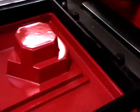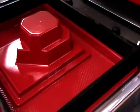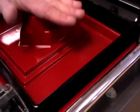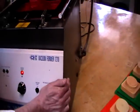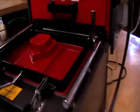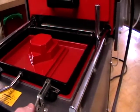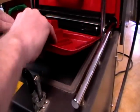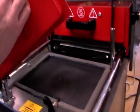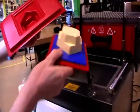How cool is that! It's still quite hot. This is one millimeter rigid polystyrene which will cool quicker than the two mil. Now I'm going to reverse to blow, push it down — that just releases the mold. Undo the toggle clamps, up we come. It hasn't released as nicely as I was hoping, but that's come out okay.